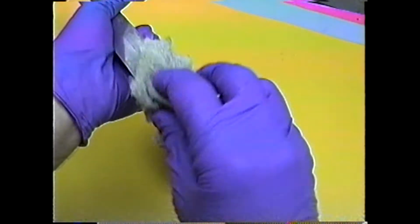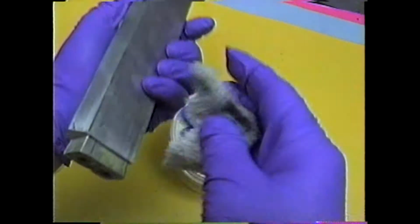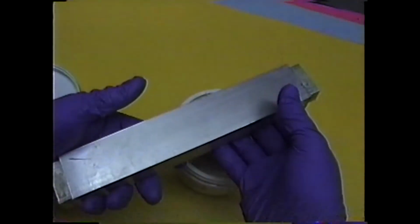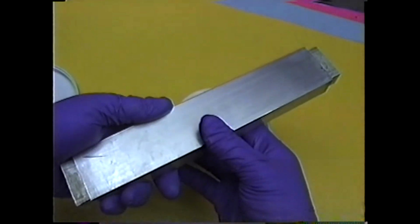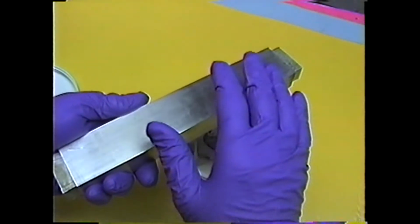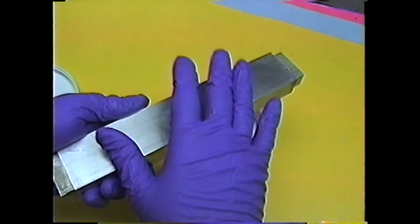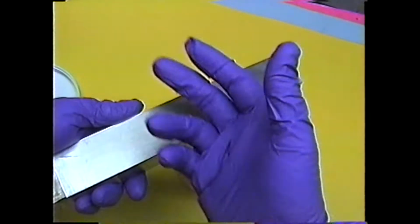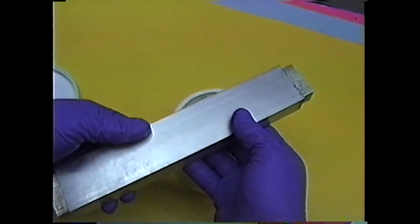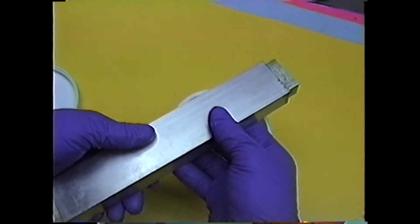So even over this old resin and everything, I try to get a coat of wax because this is going to ooze resin when we're done. There's just no way you can make this neat and easy. Now, I usually would put on a new mold, I'd put 4 coats. I'd wait an hour. I'll buff this off about a minute later. Give it about 60 seconds. Wait an hour, give it another coat, and then repeat that cycle about 4 times. But once a mold gets used and it's not green anymore, what happens is you can get away with 2 coats or maybe even 1 coat.